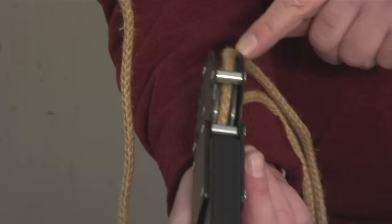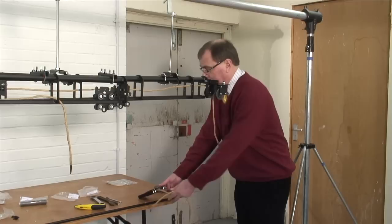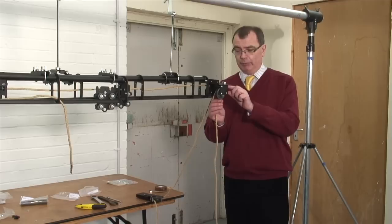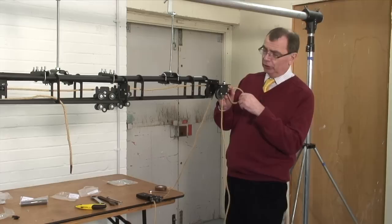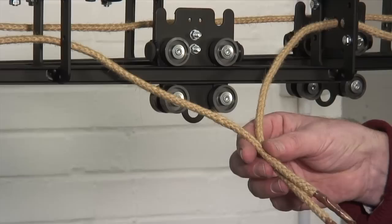As you can see, it goes behind those steel supports. For the next bit you may find it easier if you support the pulley. We now start to thread through our second pulley, again making sure we go around the supports, onto the next piece of track, through the line guide, and we come to the center like this.